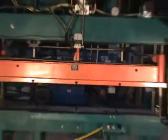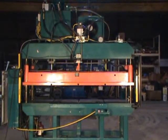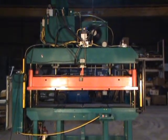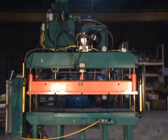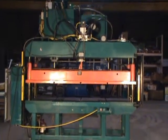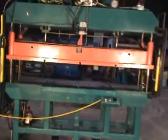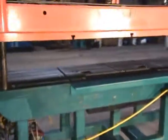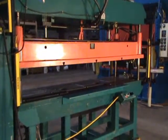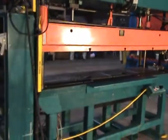This is Alma Machinery number 3914, 15-ton D&D four-post hydraulic press. The maximum capacity of this press is 15 tons at 3100 PSI. The maximum stroke is 10 inches. The maximum daylight to bed is 19 inches. The bed size is 104 inches right to left by 28 inches front to back.